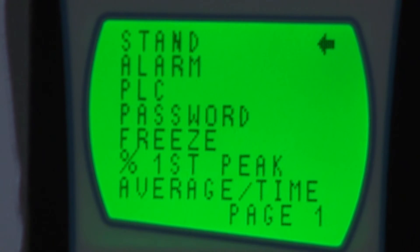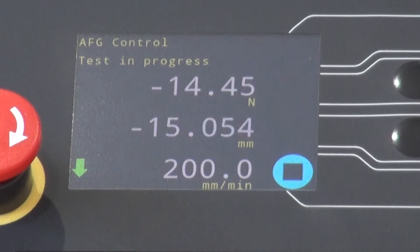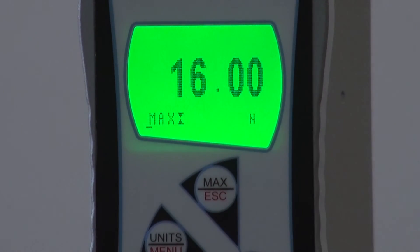In this case, we also need to prepare the advanced force gauge. In our example, we use the stand control to reverse. The test direction is down. We want to go to a force limit — in this case, minus 16 newton. Minus for compression. When running the test, the gauge reaches 16 newton exactly, stops the cross head and reverses to the starting position.